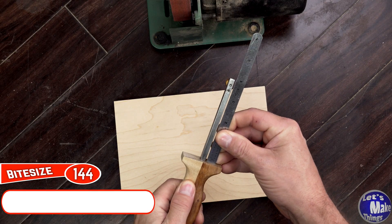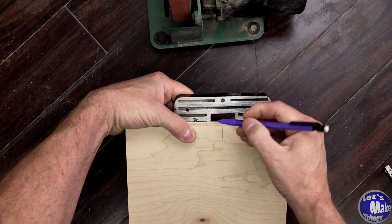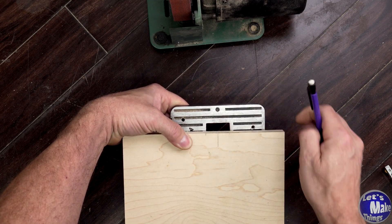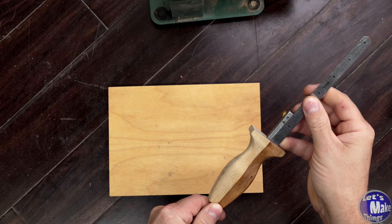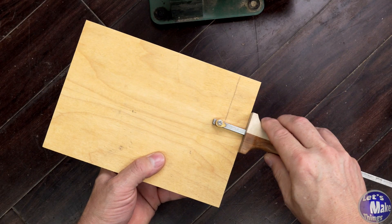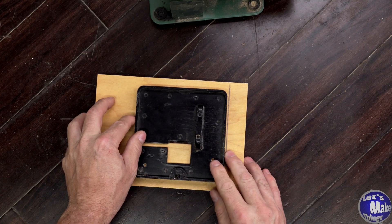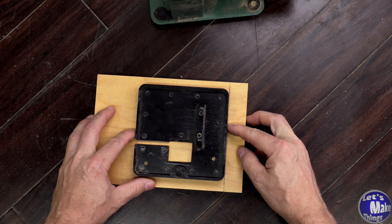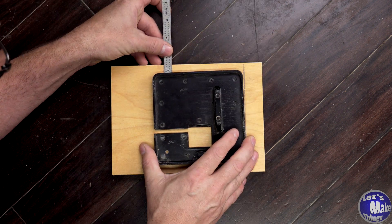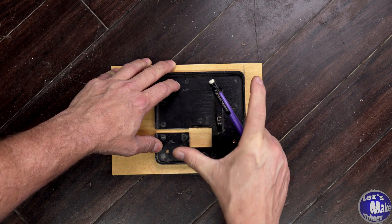I want to measure in three and a half inches on one side. If I center this on the top, I'm going to need to cut out about this to this based on my square pattern right here. I'm going to go ahead and set my marking gauge to an inch. And on the backside of the marks that I made, I'll flip this over and add my inch across here. If I take my platform and put it on the back, this is going to line up like that. So what I need to do now is to center this on this block — it's about a half inch on either side. With this set in place, I can add a mark, and this is what I'll need to cut out in order for this to slide on top.